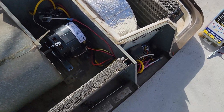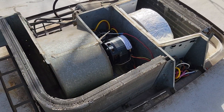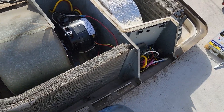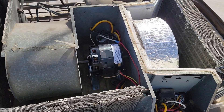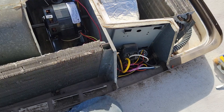I know the wind noise is gonna be pretty bad, so sorry about that, but I just wanted to give you guys a tip on replacing your blower motor. This could be for anything, but specifically we're working on an RV here. We've got a dual shaft blower motor — this is a five wire, and the previous one was a six wire. This may be confusing to some people, but all you have to do is make a jump connection.